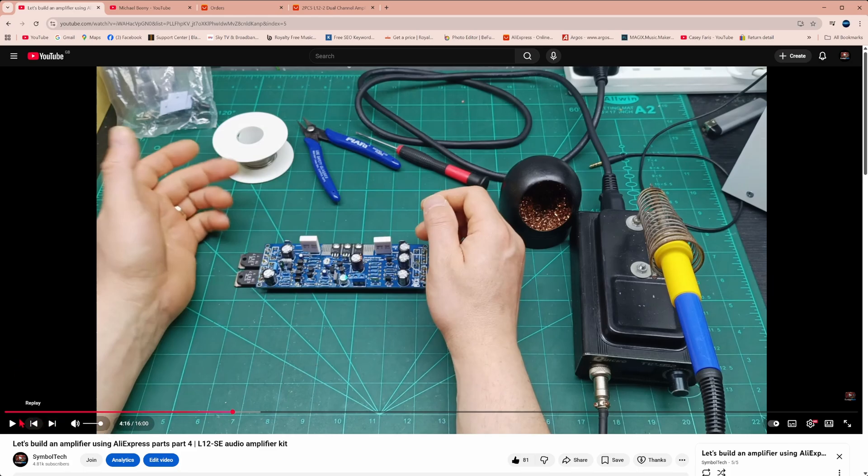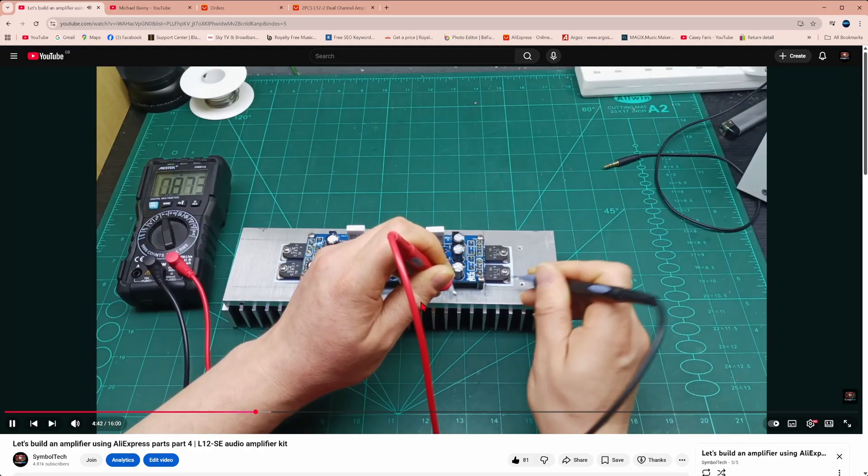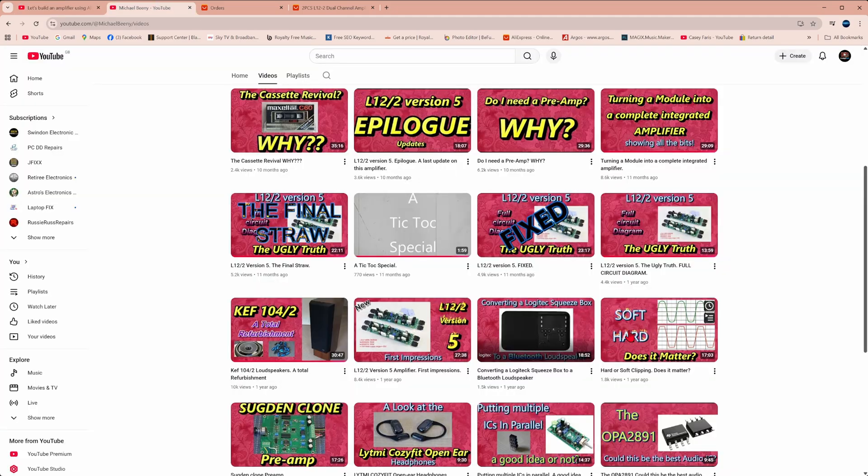The one I built a while ago you can see in a previous video - it's a quite bigger size. I also watched a few videos by Michael Benny where he built it and apparently had some issues saying it was unstable and not working fine. He did a few videos fixing the issues, so I'm going to have a look at his videos too. I already traced the PCB board and had a look to see if it's similar to the previous version - and I can say it's a totally different schematic. On the previous version the transistor in charge of the bias was an NPN transistor, and in this one it's a PNP transistor, and how the connections go around the PCB is totally different.